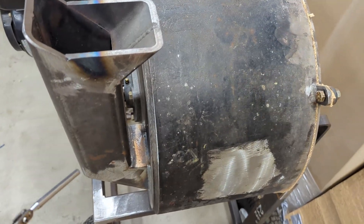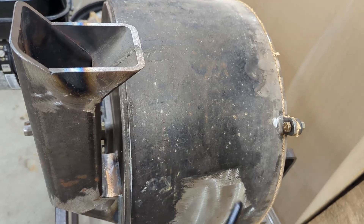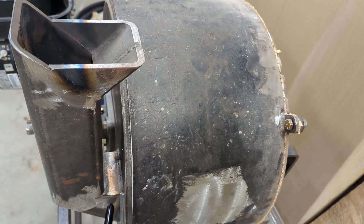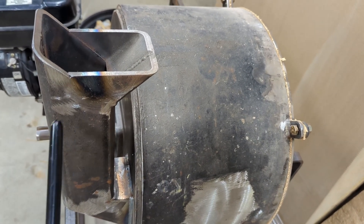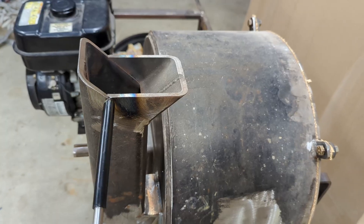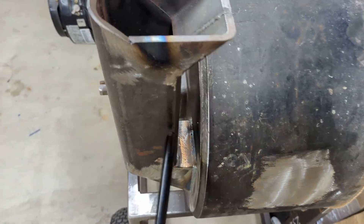Here is the rock inlet, and I probably should have added another kink. You can see the inlet is on the back rather than the top. That way, when rocks are being destroyed, it doesn't shoot straight back up into your face. This kink allows it so that if rocks do shoot back, they end up back in here and fall back down. I probably should have had another kink up top so the inlet was over the top of the tube, because rocks still tend to shoot straight up once in a while, and another kink would deter that.